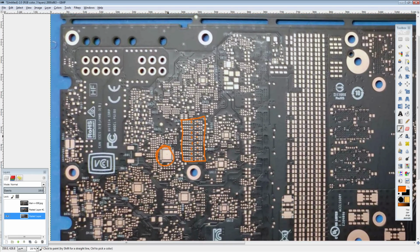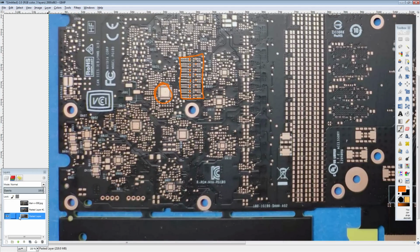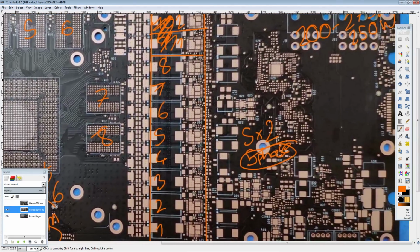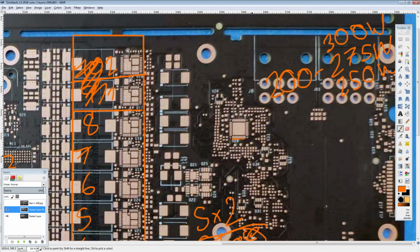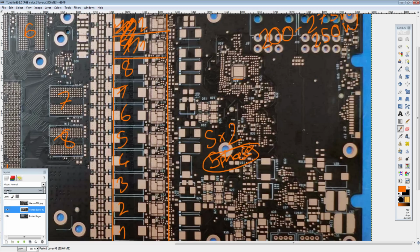I mean, wait, you'd need 8 PWM signals, then you'd need 16 current sense. That would still leave you with, like, 26 pins for other stuff. Yeah, you'd be fine. Normally, most other 8-phase controllers, for example, another 8-phase controller I can think of off the top of my head is the CHL8228G, and that thing is 56 pins. So that one has 6 pins more than that. Yeah, so that makes sense. Just checking the pin count, that it's not literally impossible to have an 8-phase off of it. There's also this thing up here, 1, 2, 3, 4, 5, 6, 7, 8, 9. This is still a 10 pin, so that's still the same thing. But yeah, they can run an 8-phase off of that.